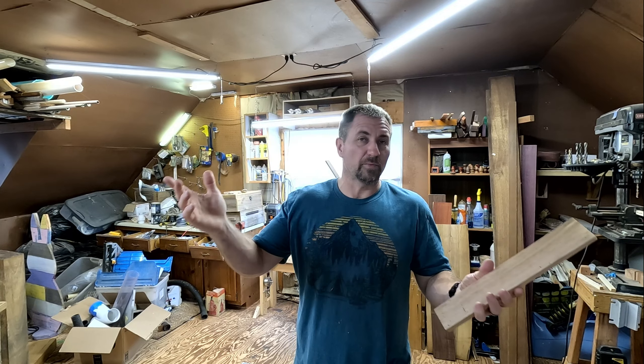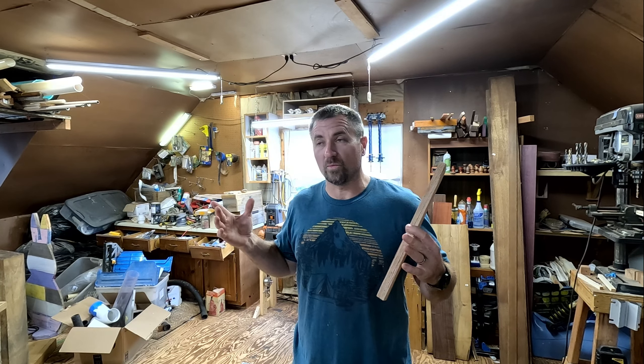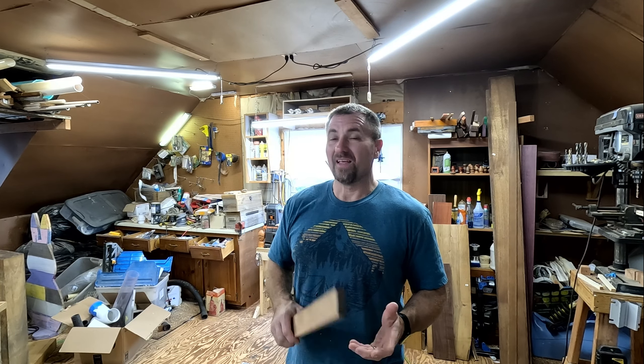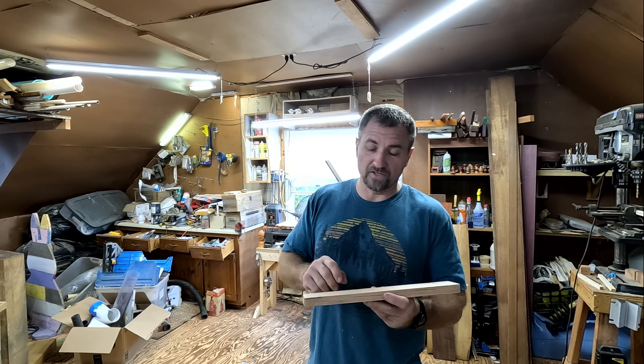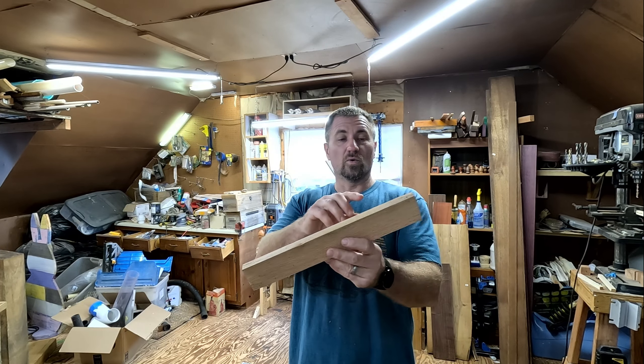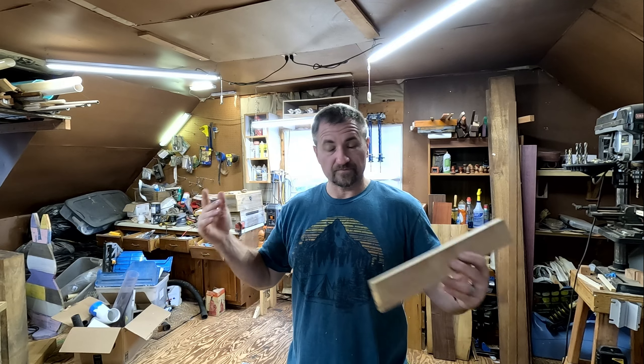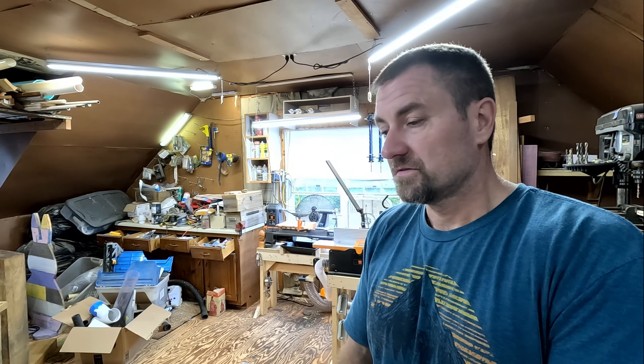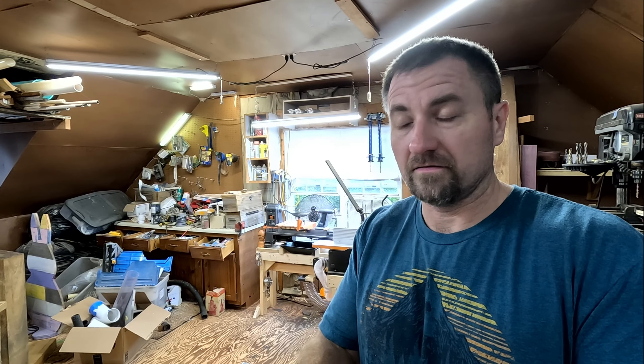What we've got to do now is cut off the parts we can't use, figure out exactly what we can use, put it together, and see how big this cutting board is going to be. Then we glue it, set it, and tomorrow come back and plane it down to make sure it's all level. Then start putting some glue and sawdust powder in there to fill in some of the bug holes or chips, because it needs to be flat.